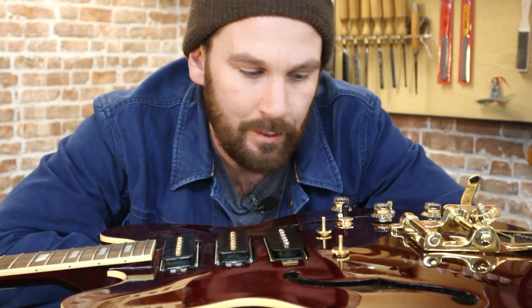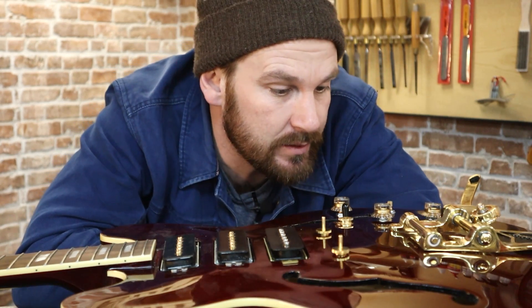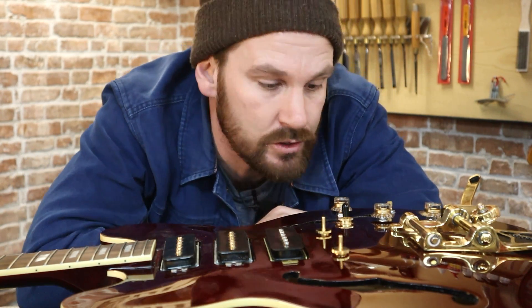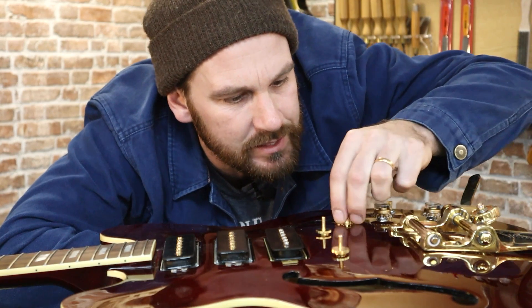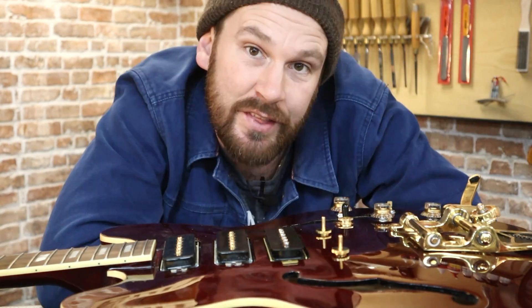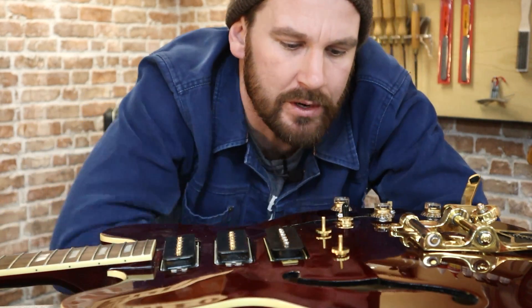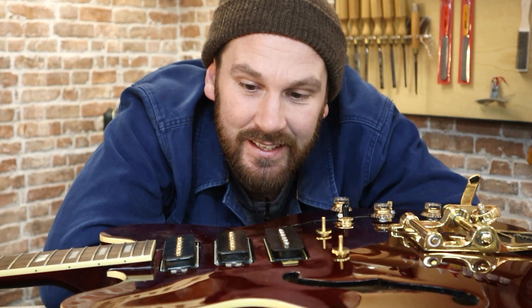Moving on to the middle pickup — luckily we've got these striking colors to follow. Worth mentioning that this guitar has had an electronics revamp: we've got Switchcraft and CTS pots, so these are decent components. Funny little thing — the switch has been mounted in quite a strange way; the hole for the switch to sit in is smaller than the barrel so it's just sitting on the surface of the body. Me and Ben actually quite like it, so we're going to leave it. Whoever wins this guitar can decide whether they want us to fix that and we'll make a little video of us doing it — simple job with a reamer. But anyway, let's get these swapped out.